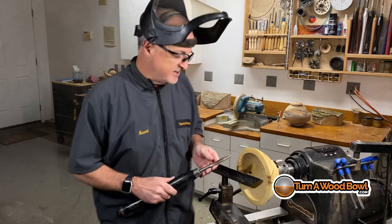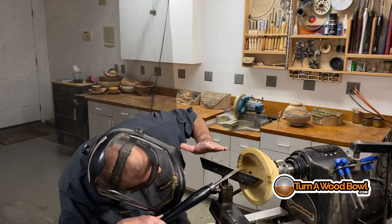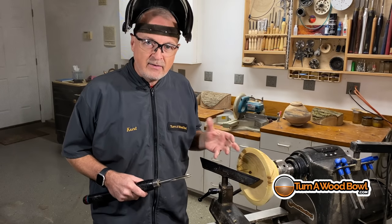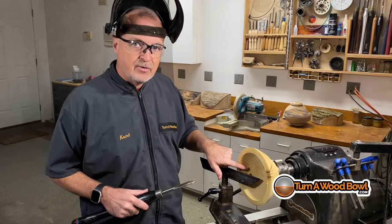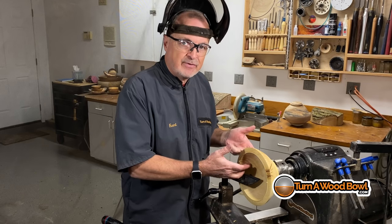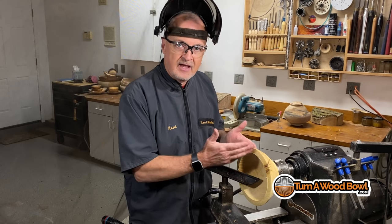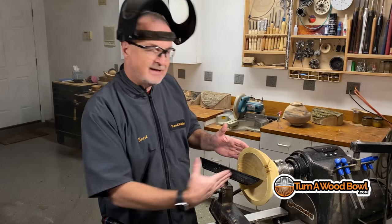Number one — this is a real common one — is to bend over and look into the bowl as you're turning, so that you've got your head down, your body over, and you're looking down into the bowl. There are a couple of problems with this. Number one, you're going to be really uncomfortable and probably have muscle aches and pains. Number two, you really have no orientation as far as how deep you're going into the bowl interior and, more importantly, how that interior is matching the exterior of the bowl. You really want to be matching the interior to the exterior the whole time you're thinning out the bowl, so that by the time you get down to the final wall thickness, everything's lined up and you have a nice, smooth, continuous wall thickness all the way through. You're not going to get that by looking in through the end of the bowl.